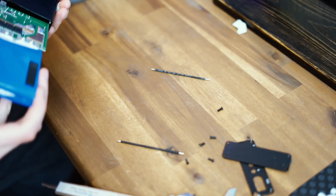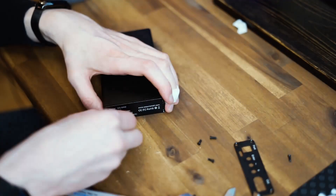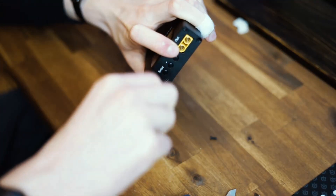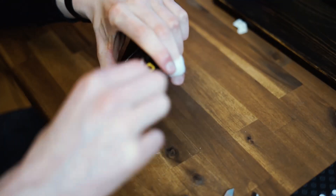Now would I recommend this welder to you? The biggest issue I had was especially the heat. Welding for a longer time — after like a hundred welds in a row — the electrodes were getting so hot that I couldn't handle them anymore and had to put them down. The inside of the spot welder got to around 50 degrees, which is also very warm. If you're welding a lot of batteries regularly, I wouldn't recommend this welder.